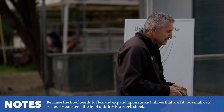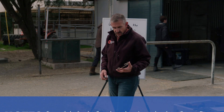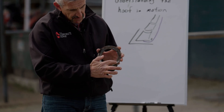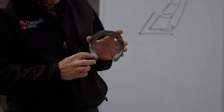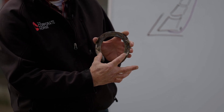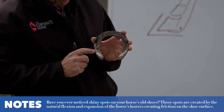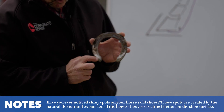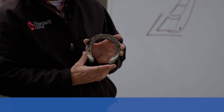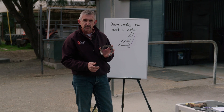What I like to do when I pull my shoes off is have a really close look at them. Hopefully you can see in the camera, but here and here you'll see some shiny spots in the shoe. That is the horse's foot expanding and contracting as he's hitting the ground and moving. You'll notice the shiny part doesn't go all the way to the outside, which tells me I'm leaving enough width in this horse's shoe for his foot to expand and contract and function properly.